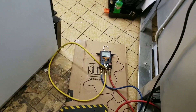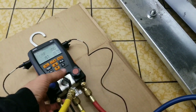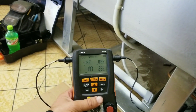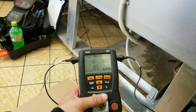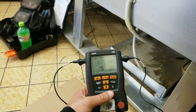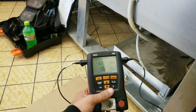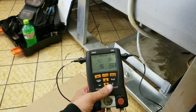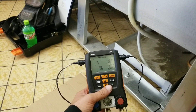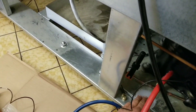Let's see what kind of pressures we got. Looks like we're doing pretty good - 108 degree condensing temperature, negative 15 degree evaporator. Our set point is negative 10, so about negative 15 to negative 20 on my evaporator is fine. Looks like we are just about all wrapped up here guys.